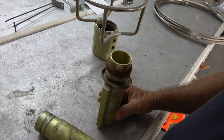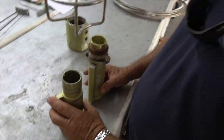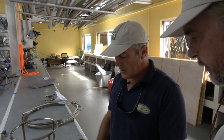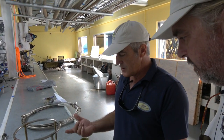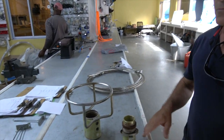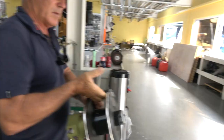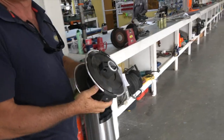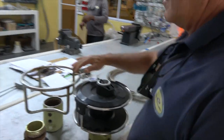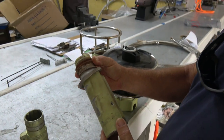Yeah, it looks like. So the circlip is really important, because if you pull on the halyard, then if the circlip is bad, the entire thing comes up. And again, water will come in through the seal, because the seal is no longer there. The seal should be on top there. Okay. So the solution is... That's the solution here. A brand new drum. Okay. So you're saying we can't fix this one, it's got to be replaced. Yeah, it's impossible. Even if we manage to get this out and put in a new kit, right?